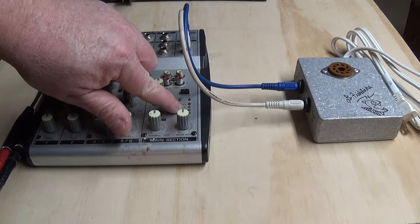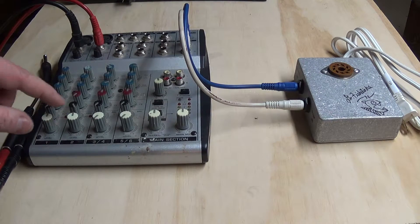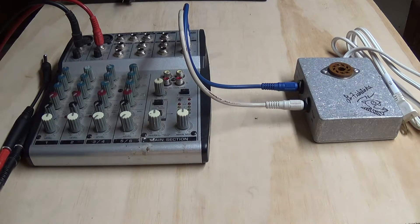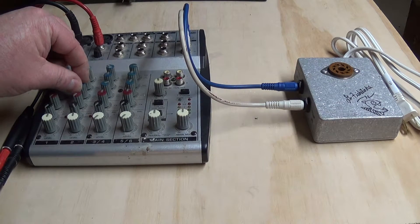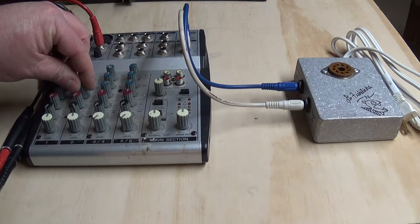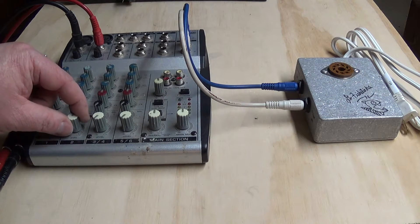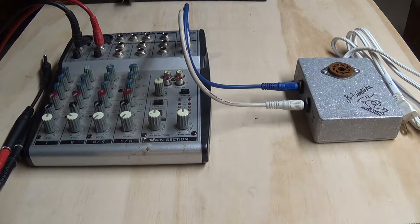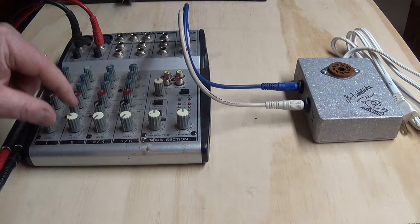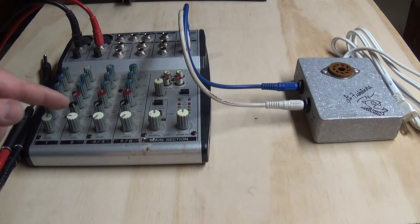Just up to around 0, so that this can be turned up and down later if you need to. These can be adjusted too, just so that they're registering and you can hear them. If you want to cut the bass in the stationary channel — essentially working like a crossover — you pull the low back on whichever channel you want to cut the bass on. If you want to cut the volume going to it, you cut that, or set the initial gain lower. You get the blend you want for the two channels.